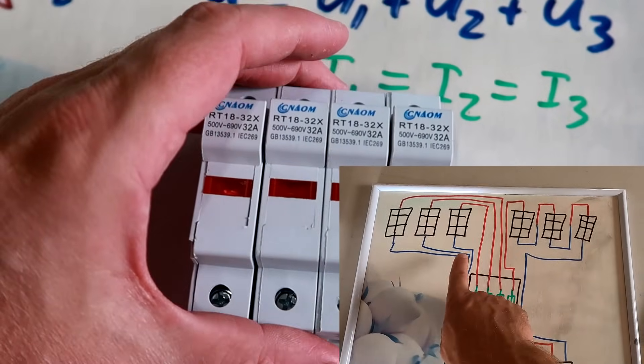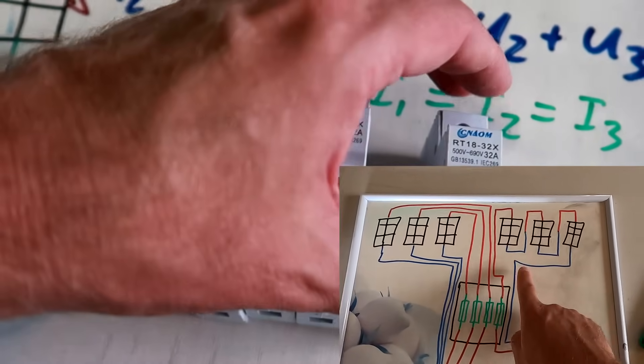As a rule of thumb: if you have a stationary system with a bigger battery — 24, 36, 48, or even 72 volts — it makes sense to put all these panels in series and run them with one fuse and one solar charge controller to charge your battery. And think about an RV which has a 12 volt board system — you put one panel on the roof and you're done. Later if you need more power you add another panel and put them in parallel with the first panel, and they both charge your 12 volt battery. From a pure safety perspective you should always fuse your solar panels as well as your batteries. This enclosure will carry our four fuse holders — three panels in parallel and one string in series.